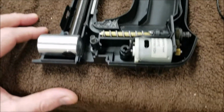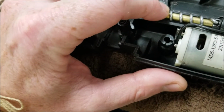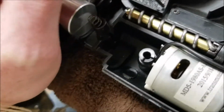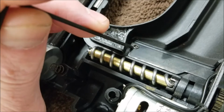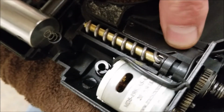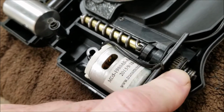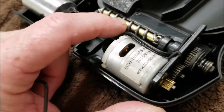If slapping it did not work, you probably have a problem with the BB getting stuck between the spring and this part of the polymer right here. Let me get something to point with. Now, I started cutting off this piece of the shaker because there's a little pivot here, and this goes up and down as your clutch gear turns around and hits it. Also, I've shaved your ears way down on these. And by the way, this only applies to these Superbirds that I've built. This is the thicker spring that really helps to mitigate jams.